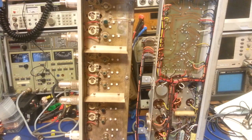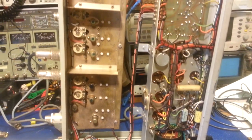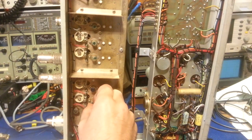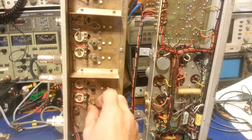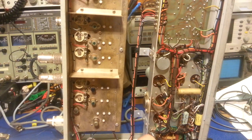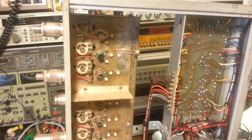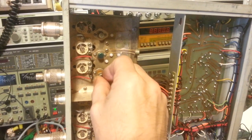One thing I forgot to point out: this is so easy to service. If you ever accidentally overdrive a stage and blow out a transistor, this little tiny vacuum tube is in a socket - but all of the transistors in this are in sockets too. So if you'd happen to burn one out or just need to test them, they're all in sockets. You could literally test every single transistor in this in a minute flat - just take your little transistor tester, unplug it, plug it in, test it, take it out, put it back. And there's a freebie included: a brand new one taped to the underside.